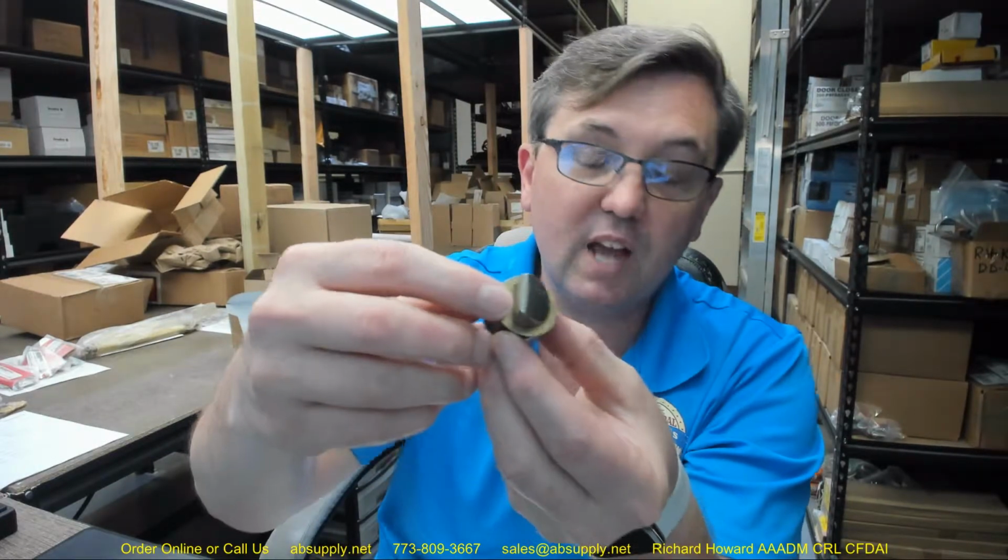Meaning, on a privacy function, if you have pushed the button in, walked out of the bathroom and pulled the door closed behind you, wanting to lock that outside lever, a privacy function ought to force the inside push button to pop out, to automatically unlock the condition of the privacy. So that latch bolt is going to be different because of that function. Surely that's the difference. Then, of course, they're spring latch, which means they don't have a deadlocking feature to it.